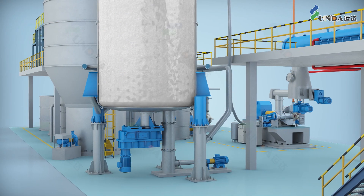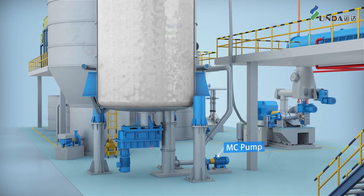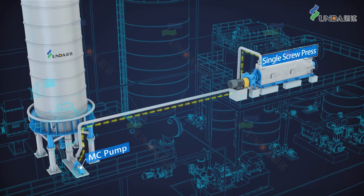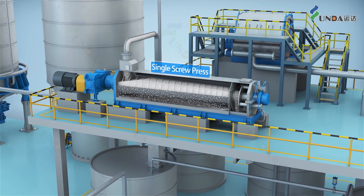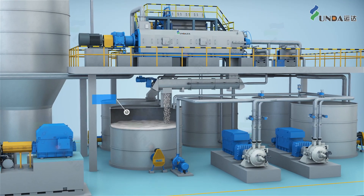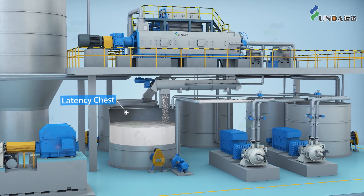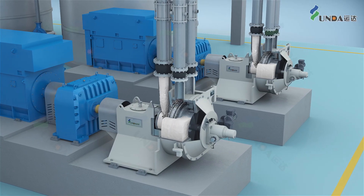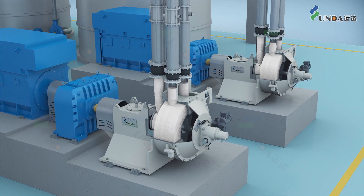After the HC tower, the shreds are diluted and then washed using an MC pump and dewatering presses. The washed shreds are then diluted in a latency chest to remove latency and then refined using a low consistency refiner to produce pulp with targeted freeness and pulp quality.